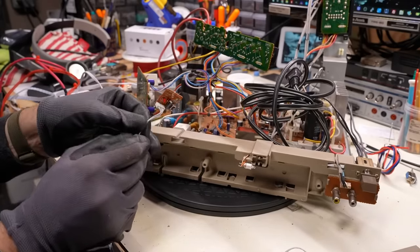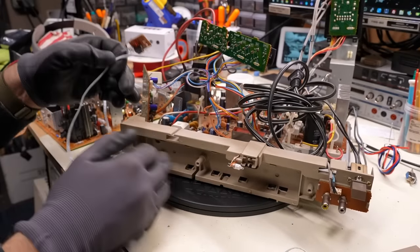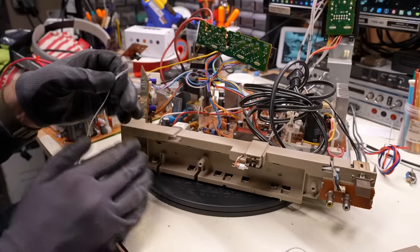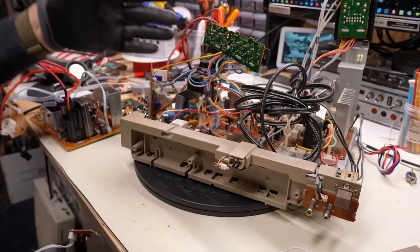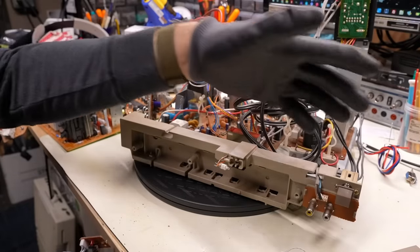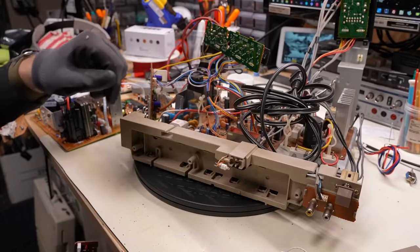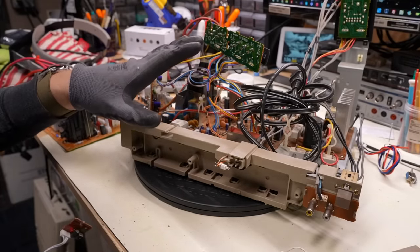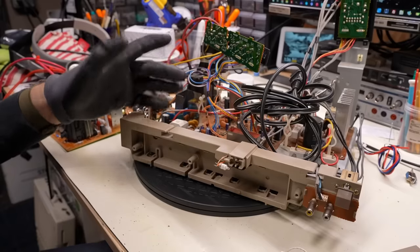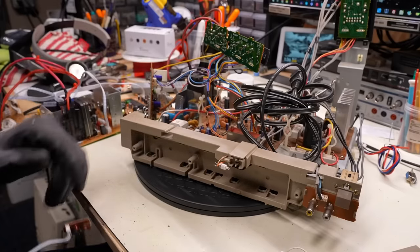This little panel here clips onto the front, and when you open the front door you see where the three original knobs and a recessed potentiometer were. I'm going to mount the control board right onto here with a little hot glue, so when you flip down the door it's visible. The IR receiver I'll mount so that when you flip down the door, it can pick up infrared signals from the remote through one of those original potentiometer holes. You don't need the remote for most functions since there's a physical power switch, and when you apply AC power it actually powers on the entire set.